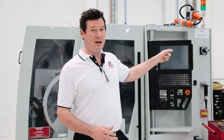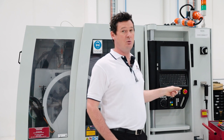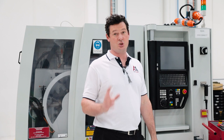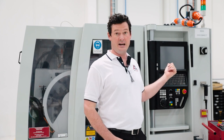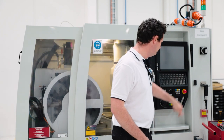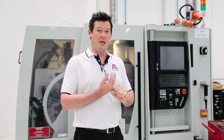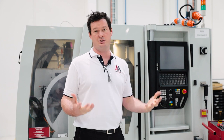I'm ready to turn my machine on. The first thing I need to do is turn on the breaker, make sure my machine has the e-stop pushed in, and then press the Control On button. You'll know the machine's been activated because the light will turn on and the screen will start up. It's then just a matter of letting the machine start itself up — it'll go through loading Windows, loading the iGrind, and then loading the application. Once the application window pops up, you know you're good to go.